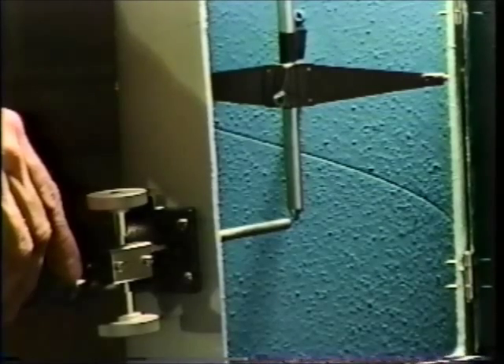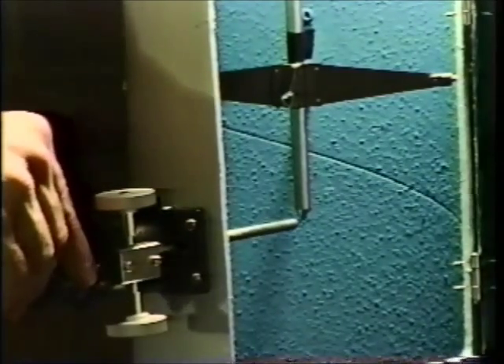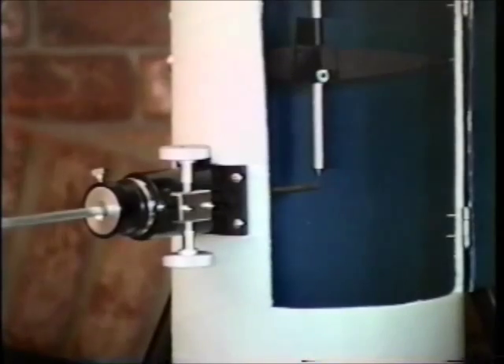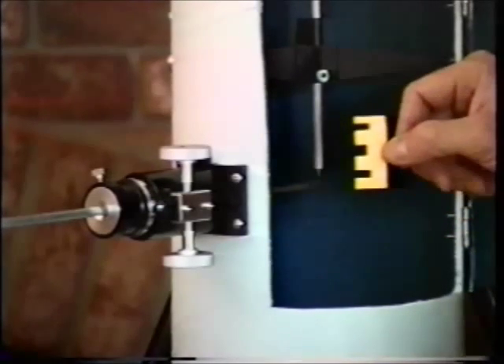Here's an illustration of what an error in the squaring on of the focuser would look like. By shimming the focuser, you can make these two axes coincide. Squaring on the focuser usually doesn't take a very large amount of adjustment. In fact, small shims made out of cardboard are all that are usually needed for this style of focuser.